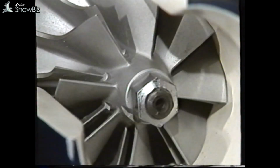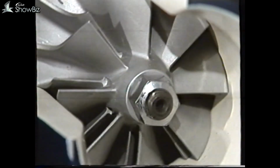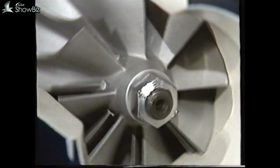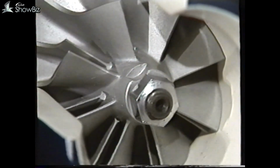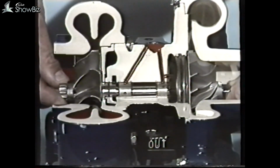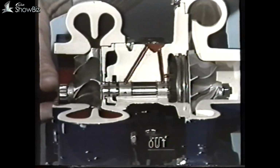To carry out this work, remove the intake and exhaust trunking. Carefully inspect the condition of all blades on both the compressor and turbine wheels. If, for example, the air cleaner trunking has allowed dirt through, the compressor wheel will be heavily pitted. It should be noted that the compressor shaft will rock on its bearings. This should not be interpreted as a fault.